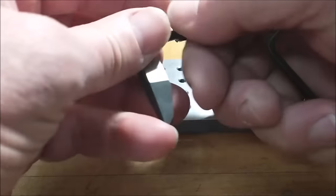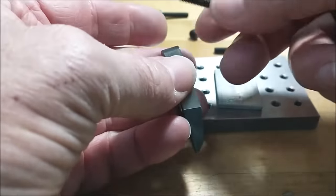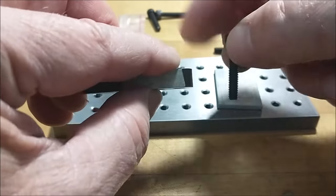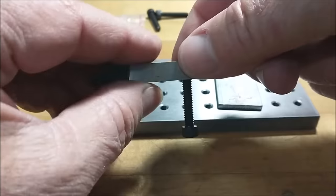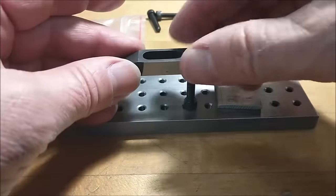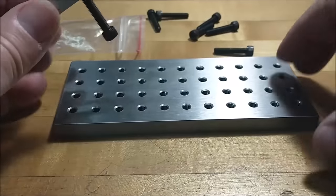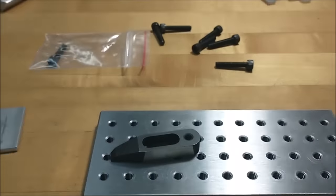Let the screw dig into a sacrificial piece and away you go. If you want more adjustability, this is a one-inch long screw — you'll get about five-eighths of an inch of heel height out of it. If you put the screw in from the bottom, you've almost doubled that. Don't be afraid to use the screw from the bottom as well. The same thing applies with the head — put it on some type of shim so you don't dig up your plate. That should be a standard setup tip.